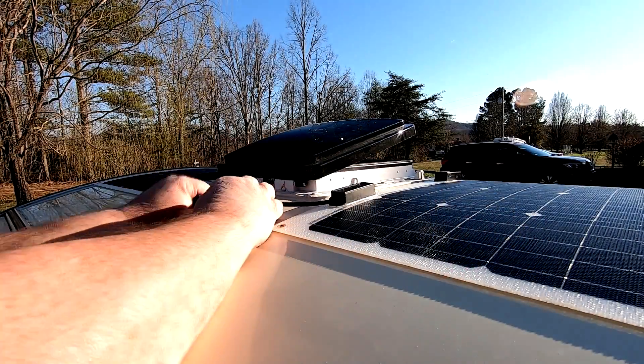Let's talk for a moment about parallel versus series. There are tons of opinions about which is better online; I did a lot of research and ended up going with series. In parallel, if you have two 20-volt panels, the system stays at 20 volts but your amperage doubles. In series, your amperage stays the same but your voltage doubles. The reason I went series is I read a compelling article saying that in early morning and late evening, in a low-sun condition, your solar panel isn't going to put out 100% of its voltage. On a 12-volt AGM battery that's fully charged at around 12.8 volts, a 20-volt panel putting out only half its voltage is only 10 volts — not even enough to start charging.